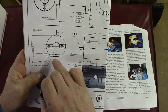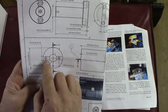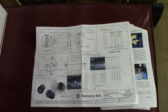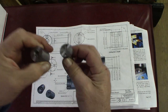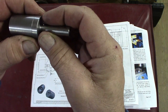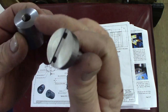There's a flat and a flat 180 degrees apart on the outside of the body. There's two holes that need to be drilled. There's a slight key and that slight key raised portion will fit in here. To make that mate together, that's what that's for. Also, these end up being at an angle across that surface.